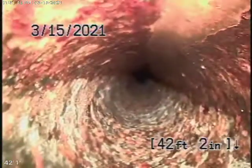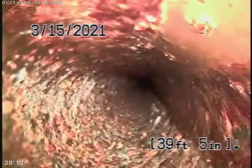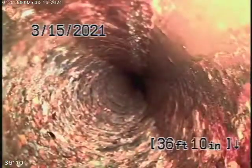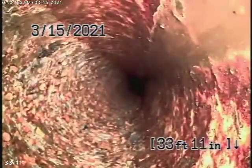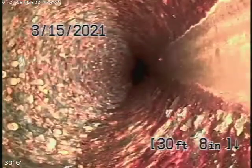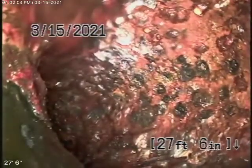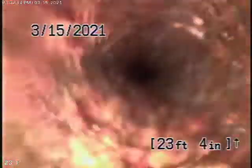This pipe is getting old. Maybe they should install a two-way clean-out outside. This pipe needs to be de-scaled. Putting it back, it doesn't look too bad in some places, but it's getting very old — the cast iron. You can see how many turns we're taking here: 90 degrees on 90 degrees. Without a sufficient number of clean-outs, it's difficult to push the camera — too many turns, not enough clean-outs.